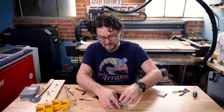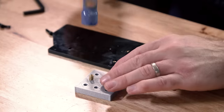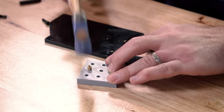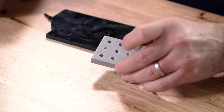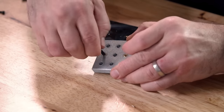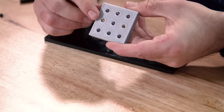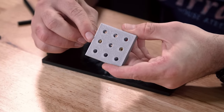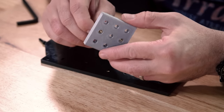I've 3D modeled the right size hole based on the manufacturer's specification, and we just tap it into place. Now I have a thread ready to go. It will be a little tight screwing in the first time because it has to expand that split area, but once you get it through the whole way it should turn easily and not come out.